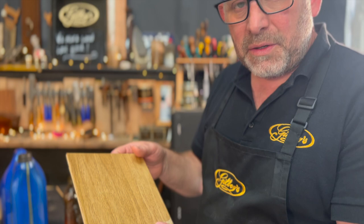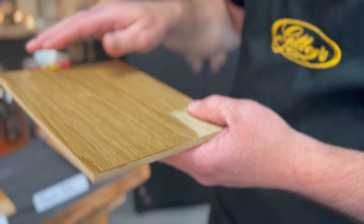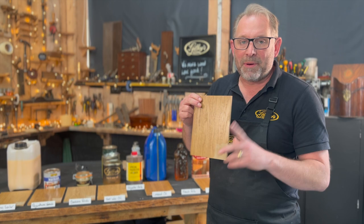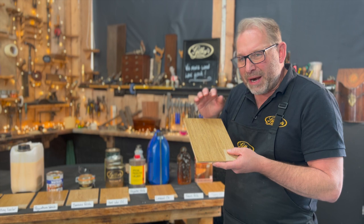French polish — I brushed and mopped it on, and it's dry. You can see it's already got a sheen; all that shellac is nice and shiny. I would cut back with some 320 grit and then put some fads of polish over it. There's no point me talking about French polish in detail here — take a look at the video I have on YouTube. There's a whole series of videos all about French polishing. It's a shiny, glossy film-coated finish, but for something like a dining table it's not the best practically.